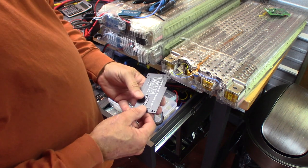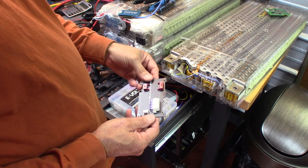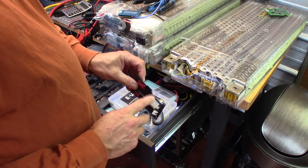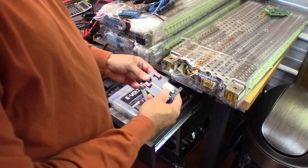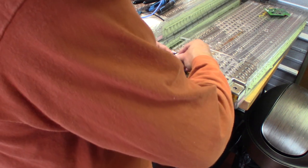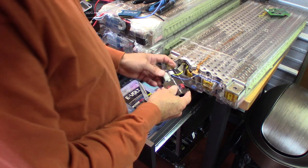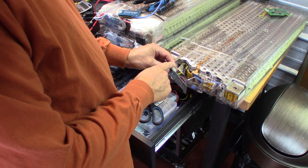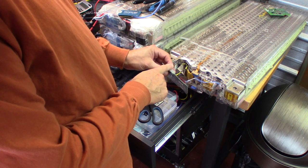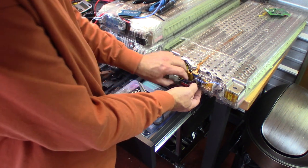Now, what we're going to do is take this daughter board from Stealth EV. The guys over there have been kind enough to go ahead and make these for us for about $30 a piece. And then the BMS will plug right into the top here. So let's plug the thermistors into the center on the white pin. And then we'll go ahead and make sure that the BMS plug on top is facing up. And I like to plug in the bottom edge connector. Just makes it a little bit easier that way.